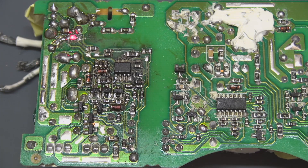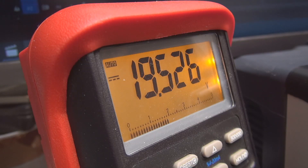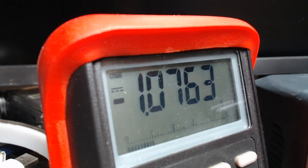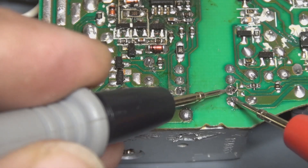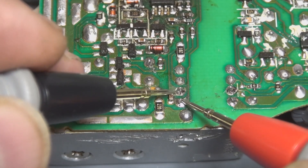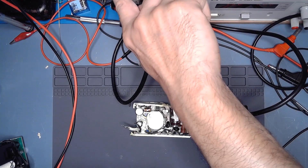Let's make some measurements — yes, we have a very nice result. The voltage on one side is about one volt, which is correct. On the high voltage side we have more than 50 volts — we have 80 volts. From the bottom we have something a little bit higher. But on the photo diode we still have nothing — I still don't know what is the purpose of this optocoupler on the bottom.